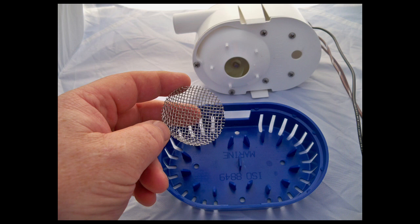Pump disassembly for maintenance is normally straightforward; however, some are more complex than others — multi-chambered units, for example. Be sure to read all instructions carefully to avoid common mistakes, such as improper orientation of check valves during reassembly of the pump.